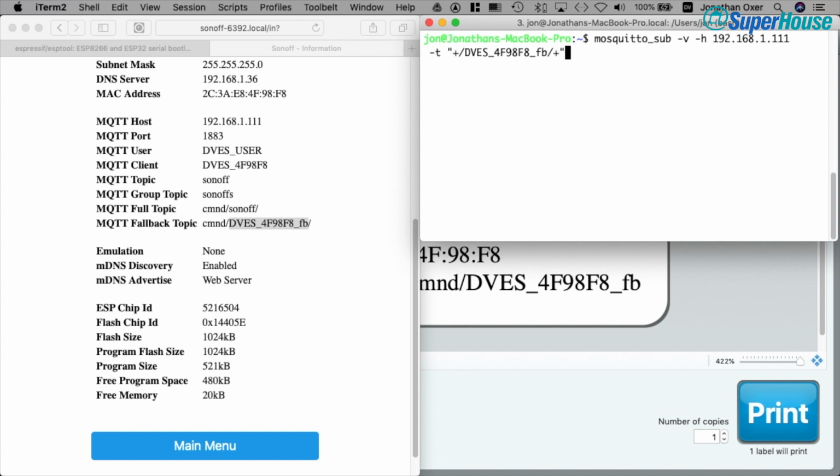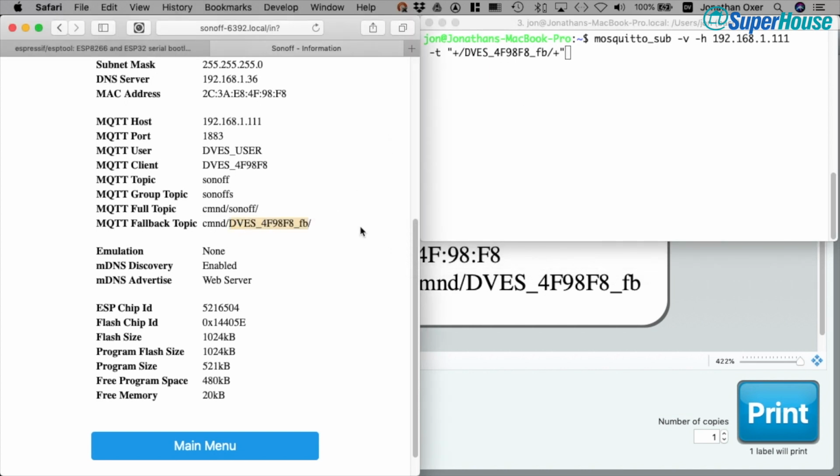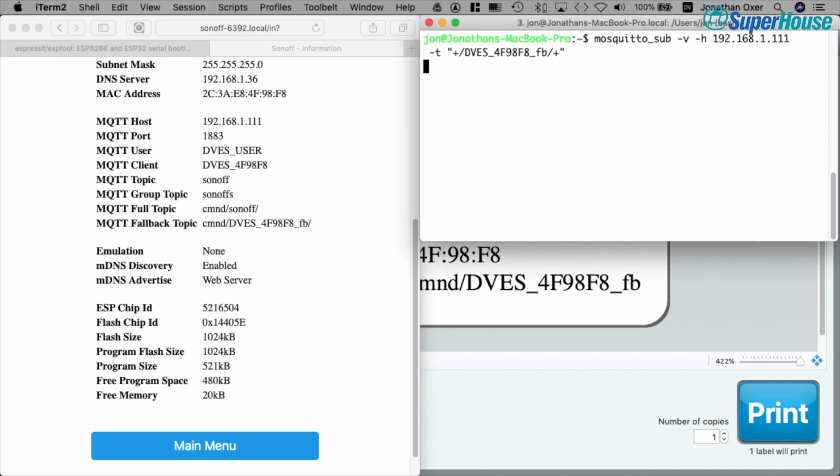So what we're doing here is looking at an MQTT topic, or a set of topics that have wildcards at the start and the end. So the topic can start with anything, it can finish with anything, but it must have this string in the middle. That means that we can now subscribe to a whole lot of different topics at the same time. And these are all the topics that are related to this particular Sonoff with this particular ID. So I'll just hit enter on that, and we now subscribe to those topics.